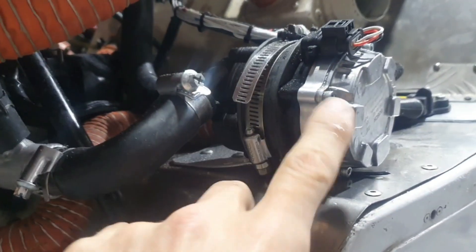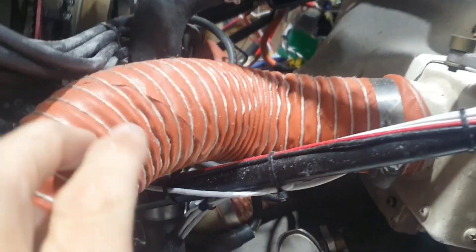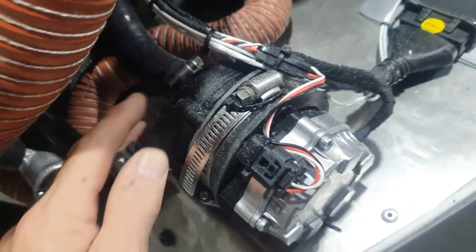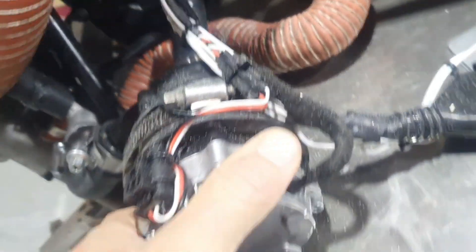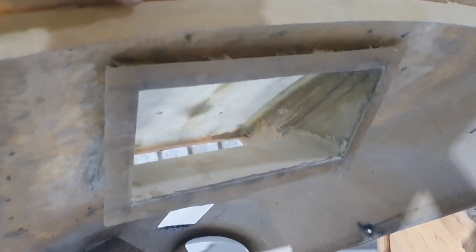The Bosch pump is feeding directly into the common rail. The cold water out of the radiator, after it's been cooled down, goes down there and into that curve and into the center of the impeller. It's mounted on a bracket with a clamp around it. It has an interface with a seal around it to give a perfect seal against the radiator and a nice curved entrance.